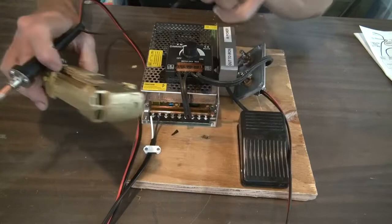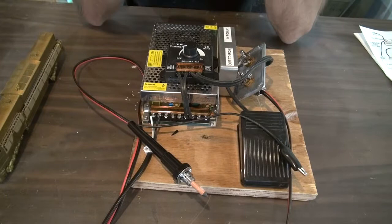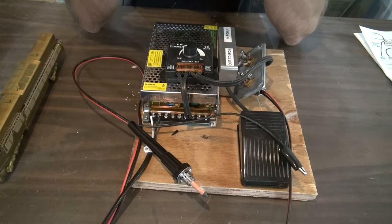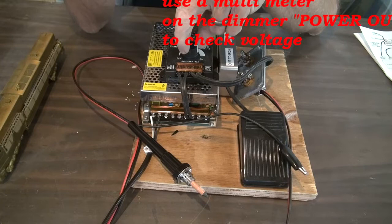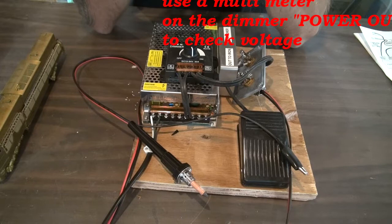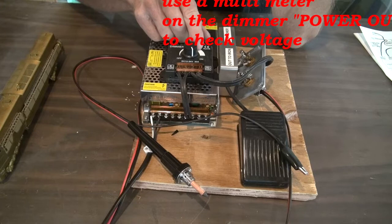It works really well. I tried this on a couple test pieces — obviously you want to do that before you start soldering onto a $500 or $600 brass locomotive. Just play around with it a little bit. Give it some tests on your own. See what voltage works best for you. I highly suggest getting a dimmer to adjust the amperage and voltage going to whichever part you're using. You could probably get a little Sharpie and mark down the different voltages — here's 6 volts, or 8 volts, and here's 10 volts, and so forth.